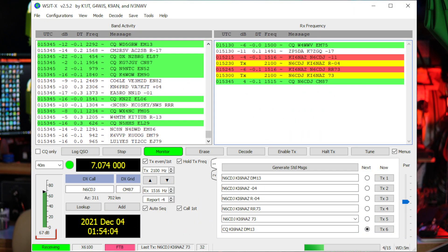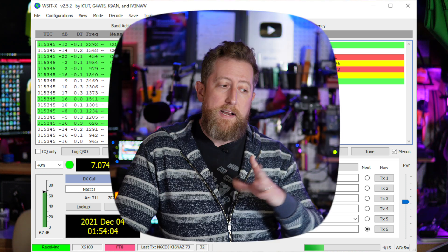Once that's all working, click OK. If the waterfall begins to populate with little squares that look like FT8, you're most of the way there — congratulations! If the volume slider on the lower left of WSJT-X (the one that goes from 0 to around 80) is showing red, that means the input volume is too loud. You can adjust this two ways: using Windows settings to lower the output of that speaker volume, or on the X6100 you can use the radio menu to decrease the incoming audio for the input jack. It should always be in the green for a nice clear decode.